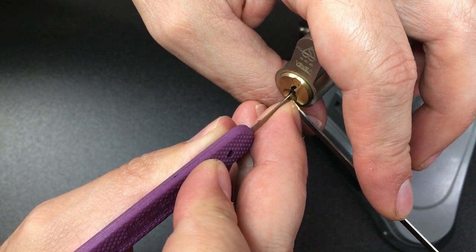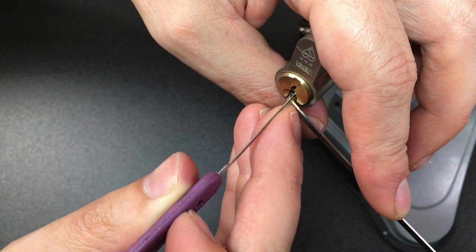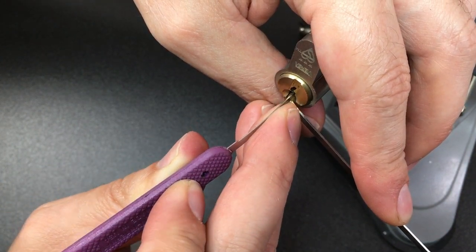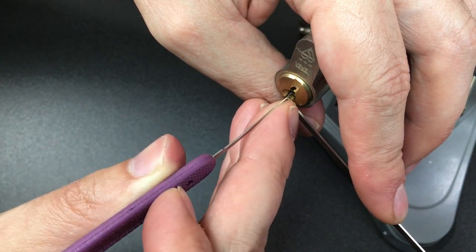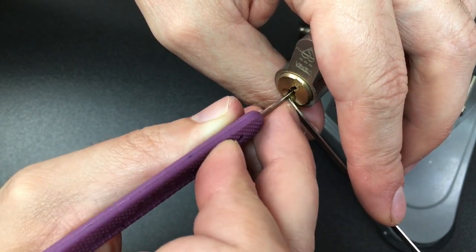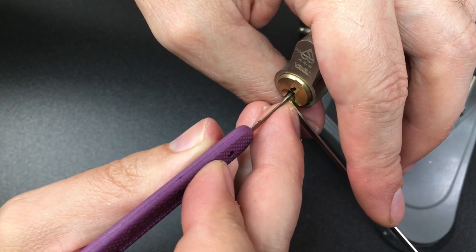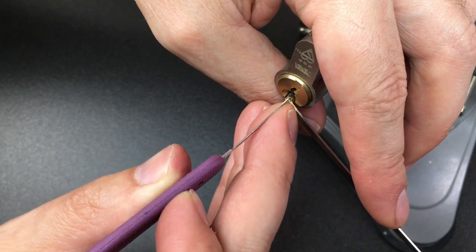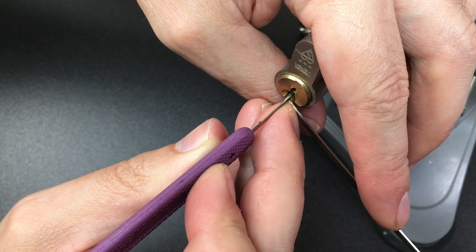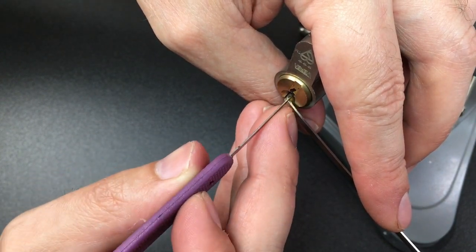A bit of tension, go in with my pick — that's at an angle — quite tight little keyway. Pin six, nothing on five, four going through. That's crunchy on pin two. Back to six — a lot snappier there. Into a false set — that was on pin four. Do you hear it? It's very crunchy in here. Pin one — I can't really describe it, it's not nice. I hit a pin and it just went into a false set. That's still pin six clicking away. Anything on pin two? Seems set even though I don't think I picked it. Okay, wiggle the pick through, go to the back again. It feels like it's picked but must be something that isn't quite 100% set yet.